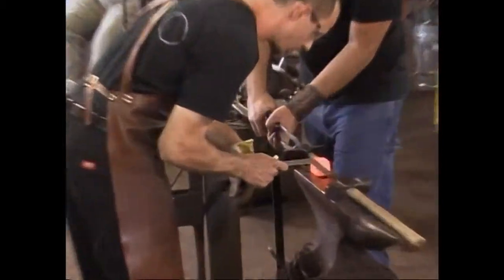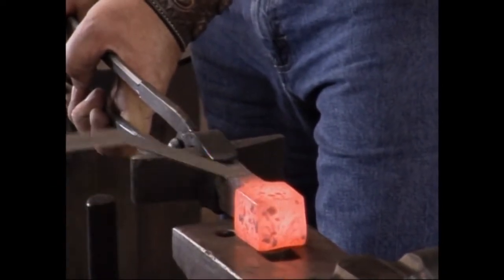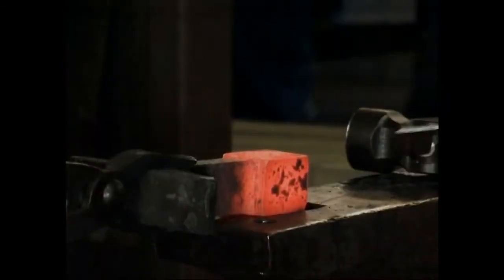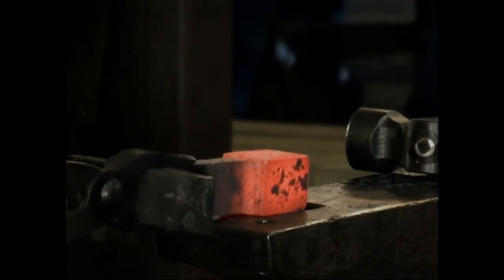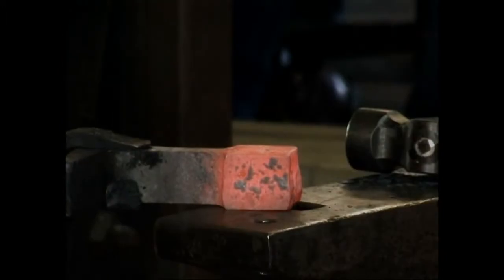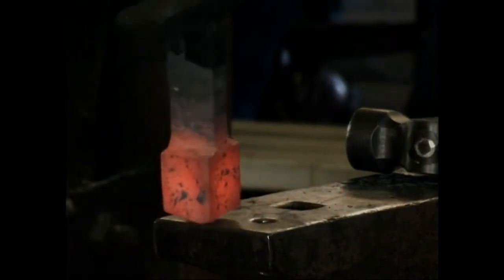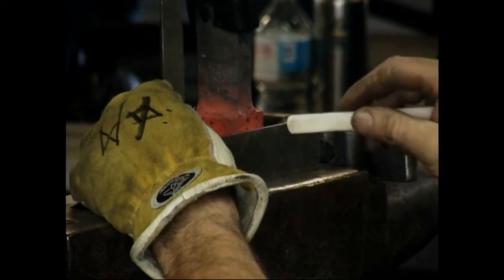Let's see what our length is here. About 2 inches. I want to leave about a half an inch of this mass without touching it. And this is about 1.5 inches wide. That's a little too tall. This is 1.5 inches. We'll use that. Rory, if you'll stand them straight up and down on the anvil. For marking it fairly quickly and straightening them that way a little, this is one of the easiest ways I've found for marking the hot metal.